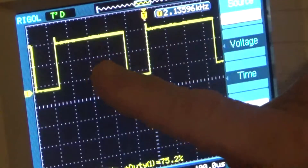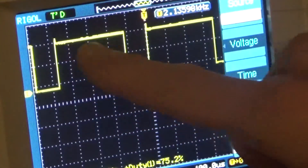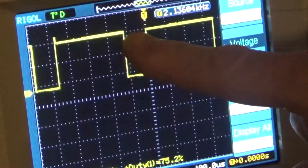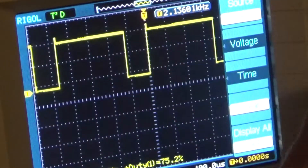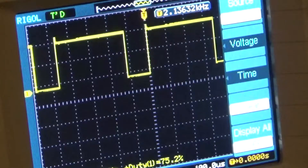If you don't know what duty cycle is - this is how much time the signal is on as opposed to off. So 75 percent of the time it's on and 25 percent of it is off. That's duty cycle. The 555 timer is faster than the program counter because the program counter is dividing down the clock to a more stable square wave.